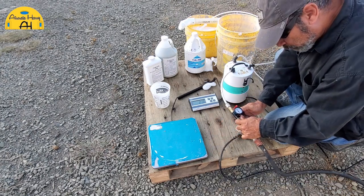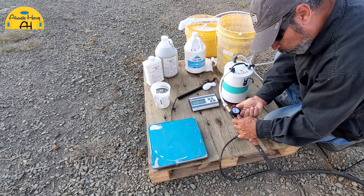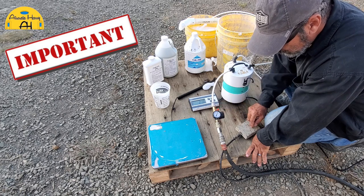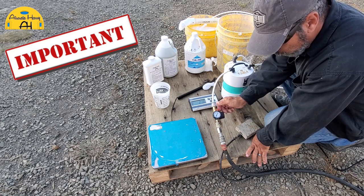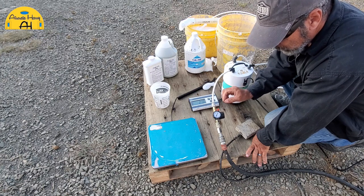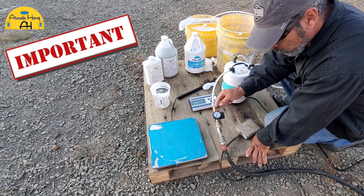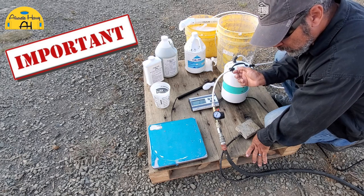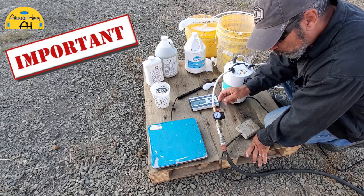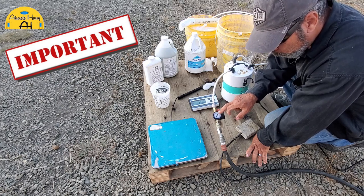The valve was set to 30 PSI — I'm going to pump it up to 45. An important technique: once you step on the pedal and turn the air on to begin making foam, this valve reading will drop down a little. The best way to test is to adjust the valve while you're actually making foam, because that gives a more accurate reading of the pressure going into the system and into the wand.